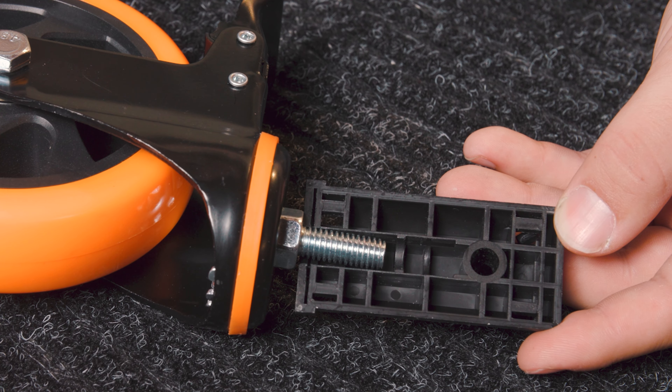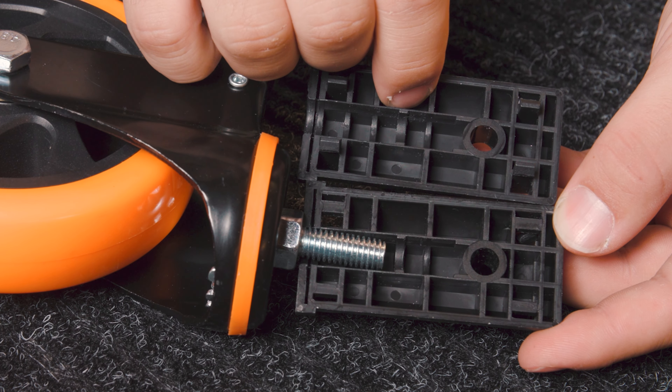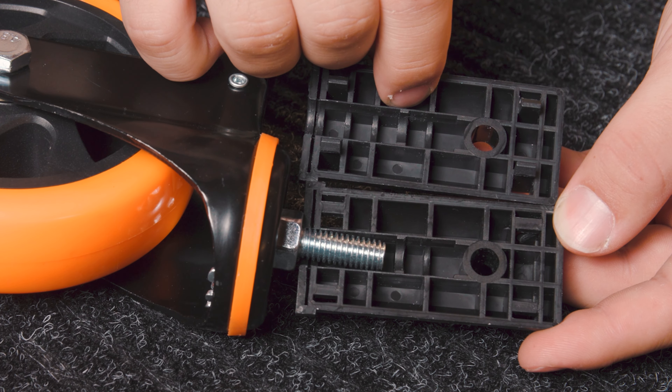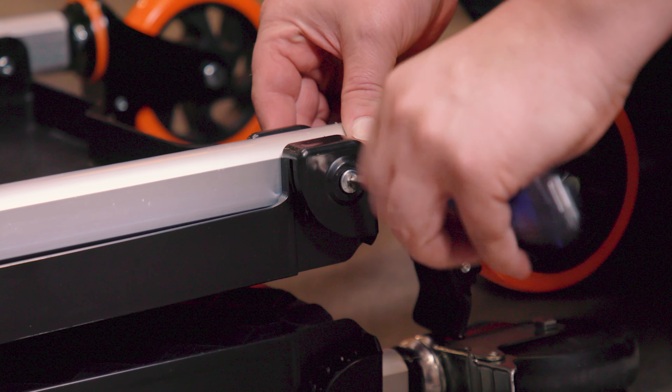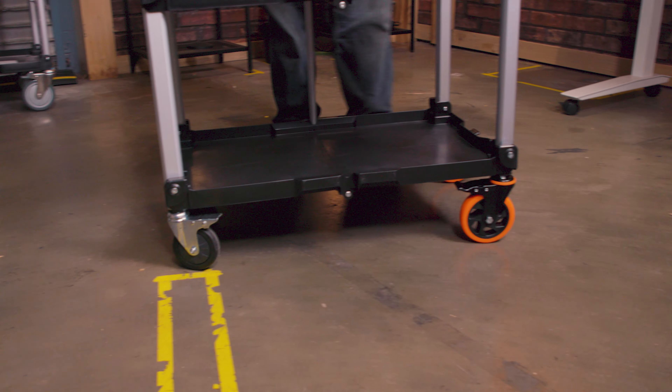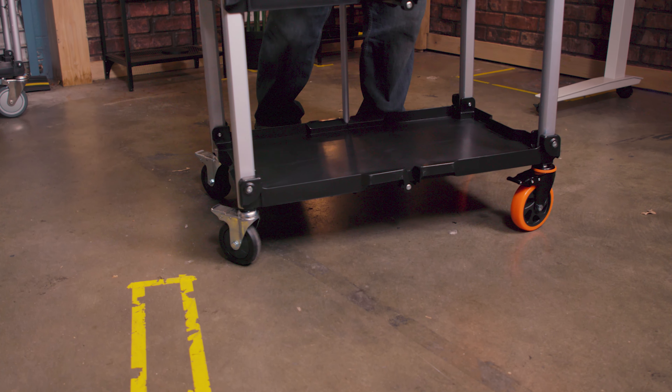When adding your caster to your plastic insert, I like to add a little bit of red Loctite. It holds it into place and makes sure that caster doesn't go anywhere. If you're not using the 3D printed part, you can use the stock one itself, but you will need some two-part epoxy to really bond the two plastic halves together and then let it set and dry for 24 hours so it cures. All the mods on this cart are pretty optional, but the one highly recommended by the community is the caster mod. Replacing these casters goes a long way to give this cart a professional feel.